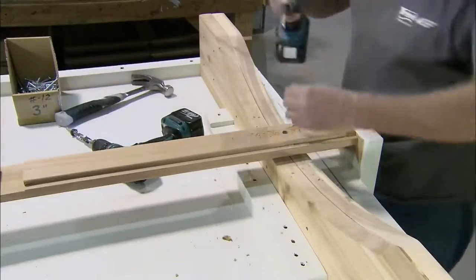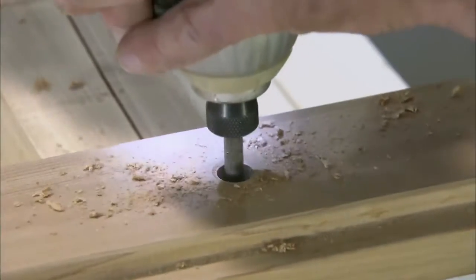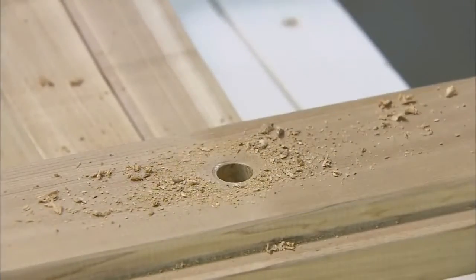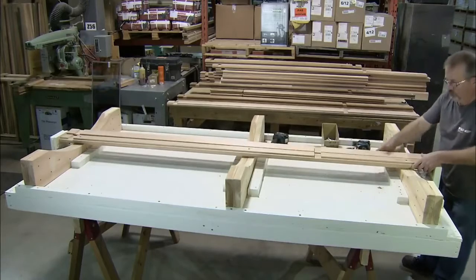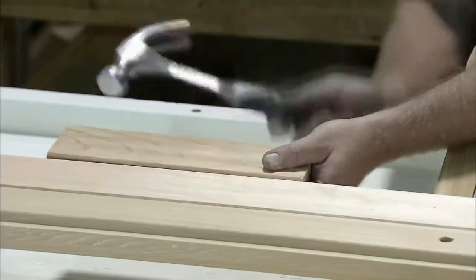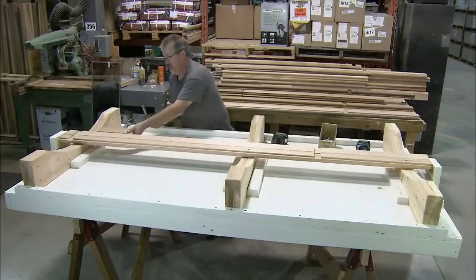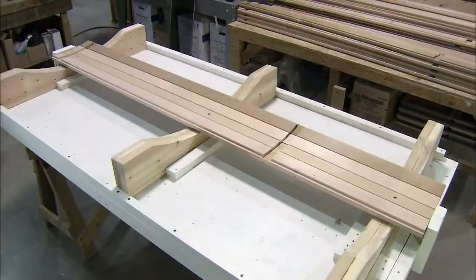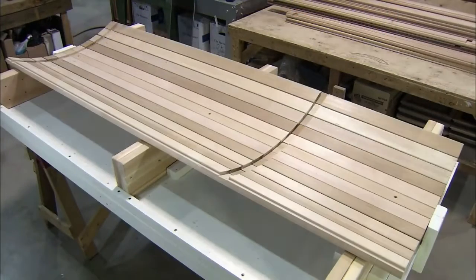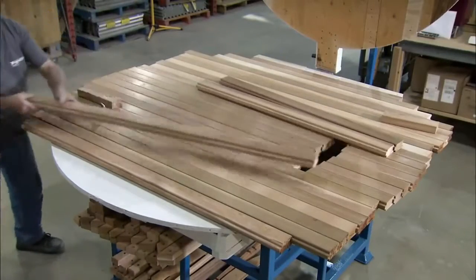The barrel-shaped sauna is then assembled in sections. The lower section starts with a central plank that has a tongue on both sides. To each of these is fitted the groove side of a tongue and groove plank. The tongue and grooves fit together so well that the joints are watertight. More planks are added until there are 8 on either side of the central one. The sauna's back wall is constructed using the same technique.